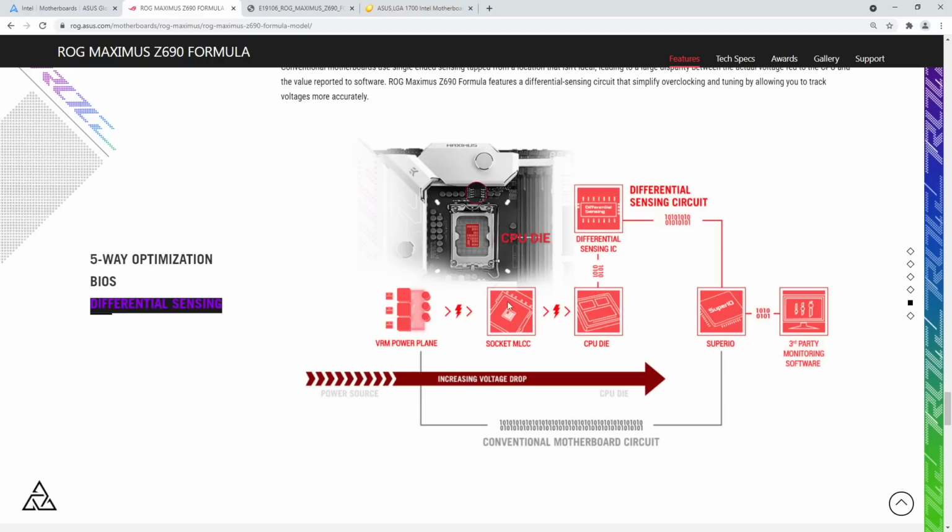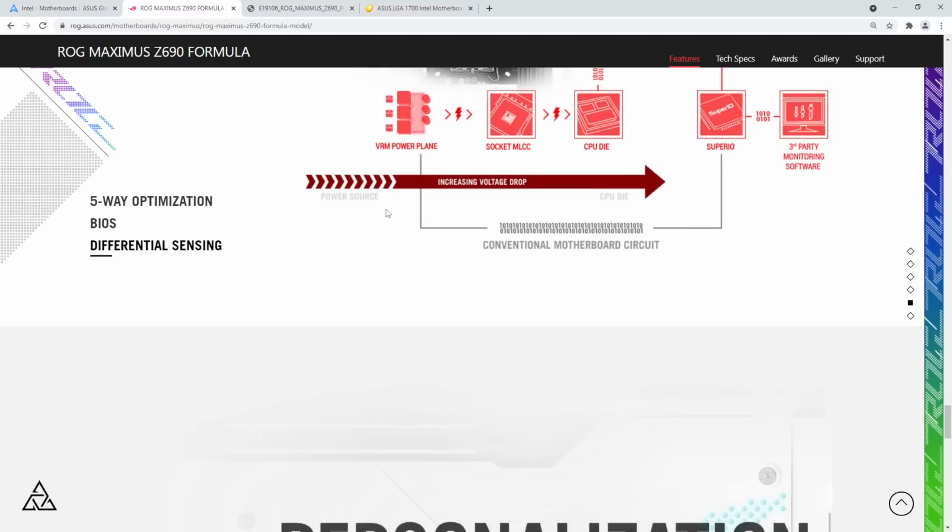Also, what's a bit unfortunate is that the Super I/O is actually kind of trash at monitoring voltages. It has 12 millivolts of resolution, so this ultimately is less accurate than if you have a motherboard that has access to the voltage controller. Admittedly, on a lot of motherboards, you don't get access to the voltage controller. So the nice thing is this always works, because the Super I/O is a widely supported chip, whereas the various voltage controllers aren't. But on the flip side, if you do have access to the voltage controller, that's just better.